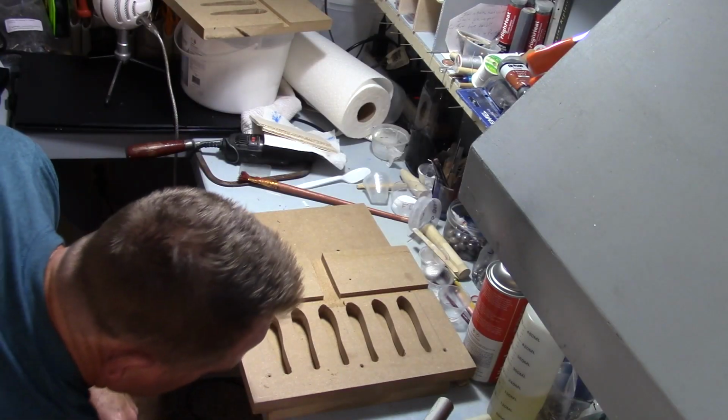Okay, so if you're going to cut this copper and make a mold yourself, I recommend you use a bandsaw or a hacksaw or something to cut it off with. If you use just a pair of cutters, it's simple, nice to cut, but it also puckers the end in as it cuts it, so you really don't want that. I mean, if you're soldering pipe, sure, you want it a little puckered to go inside a fitting, but it's not really conducive for what we're doing, so I always just cut it with a bandsaw. Got a mess in here.